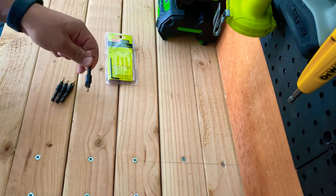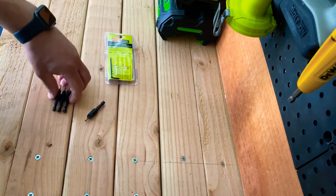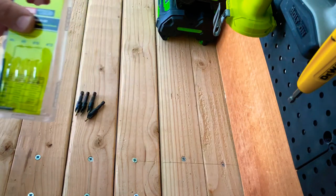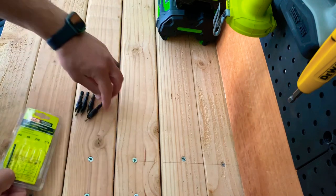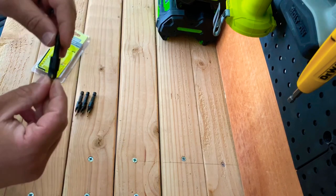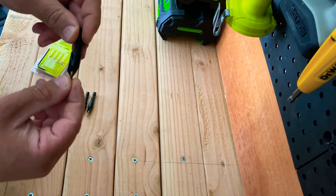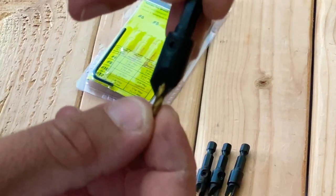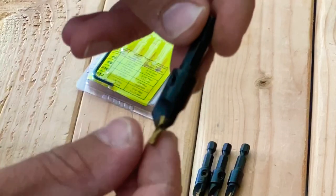You don't need this in every type of woodworking — this is more for finished woodworking, but when you use it, the results are awesome. Much cleaner setup. You've got this little Allen key along with the set that's used to adjust the drill bit part. You can bring it in or out to set the depth on how far the pre-drilling is going to be for the length of the screw. You could even find a different drill bit to fit in there if you need a really long pre-drill.